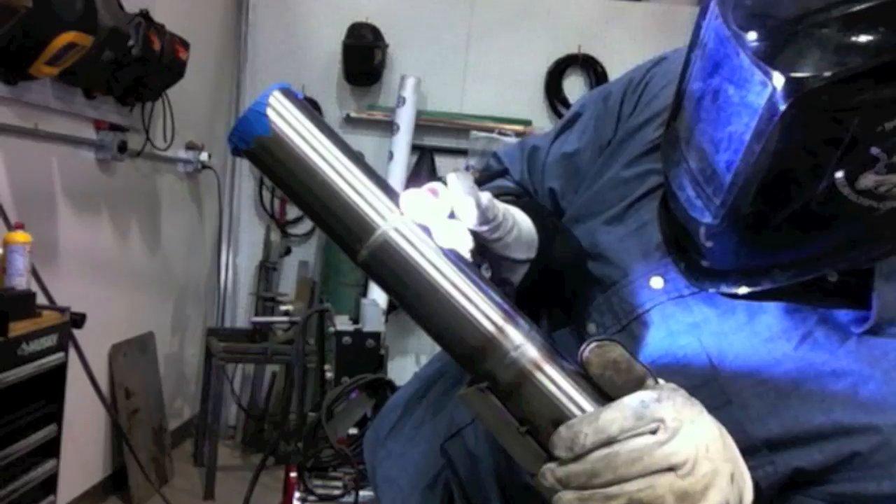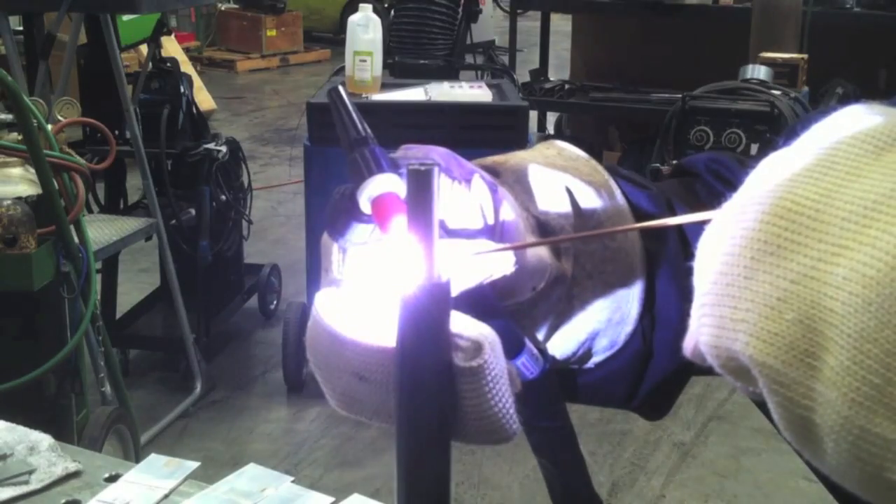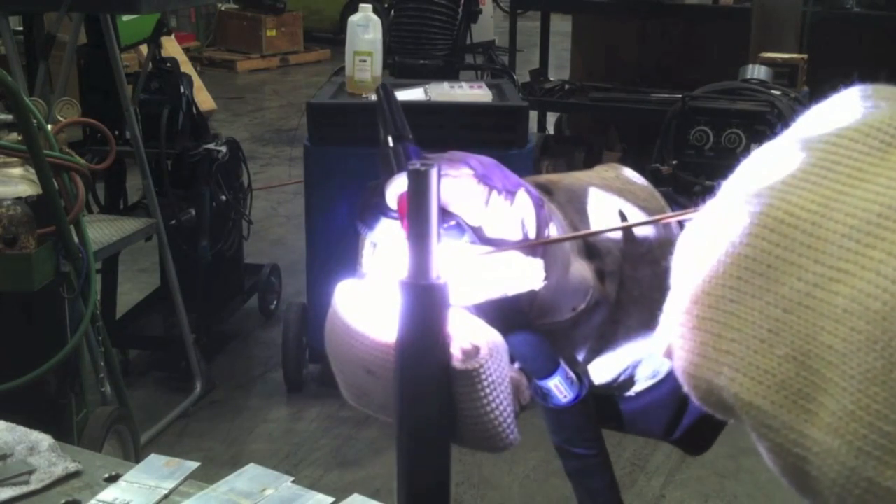For sanitary stainless tubing, the tubing is really smooth and polished on the outside, and the TIG finger lets you slide along, make nice little increments, really helps with the uniformity of your weld, and your hand doesn't get hot. For small aluminum joints like this outside corner joint, vertical uphill, the heat builds up really quick and if you're propping on the metal itself you won't hang in there long. For small round parts that you put up in a vise, the TIG finger lets you prop and ease all the way around a joint without stopping.